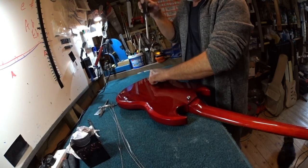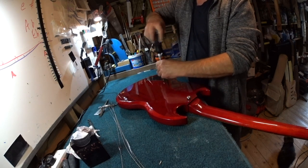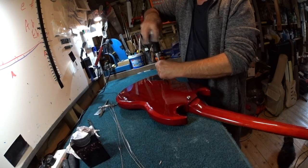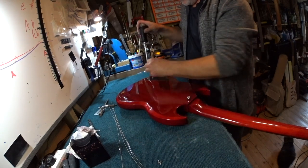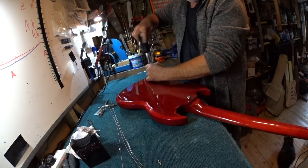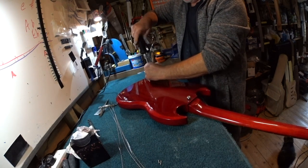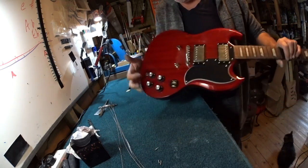I have a tool that I could tie it down from the outside without going behind here, but I want to make sure that because it's come loose already, it's very likely to have stressed the wiring in here. That's one of the rules of thumb of guitar electrics, that they don't like movement. Solder does not like movement, and that's why I think this was a bad design.